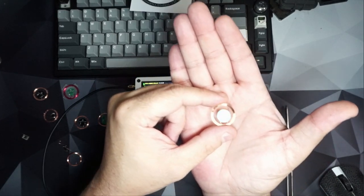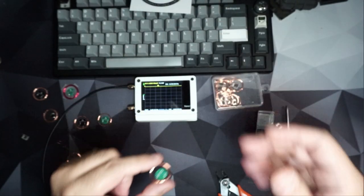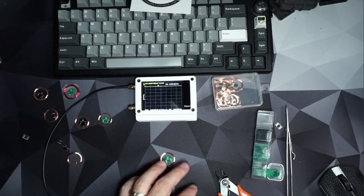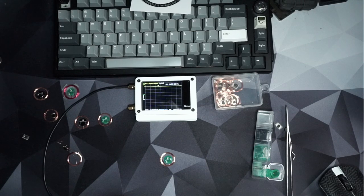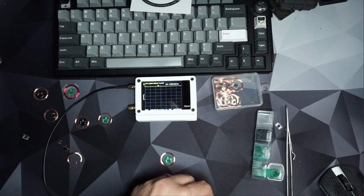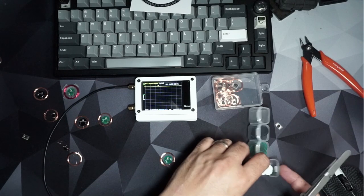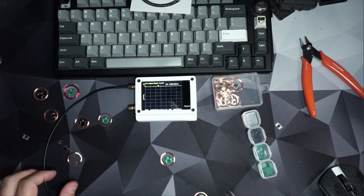The leads are through. Next, I'm going to either use a calculator to determine the correct capacitance or the correct capacitor to use for this particular antenna, or you can do it the quick and dirty way, which I did — use a whole bunch of different capacitors to try to find the one that matches best.